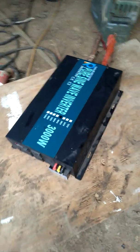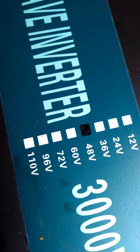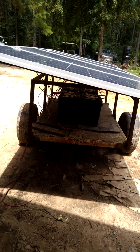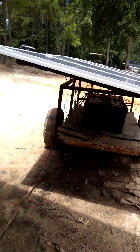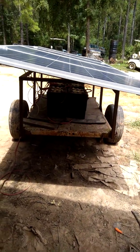I'm doing it because I wanted to show people that with this cheap controller the system does work. You don't have to spend a big pile of money to make something like this. These little inverters on eBay are like $300, and they'll make it whatever voltage you want — 12, 24, 36, 48. This one's a 48 volt. I got it hooked up with jumper cables; it's not permanently mounted. This is something I'm doing because I wanted to charge those eight batteries up. Down the road I'm going to use it behind my golf cart and take it where I want on my homestead — if I want to put power on the bottom of the property, I can. I can run my welder with this.